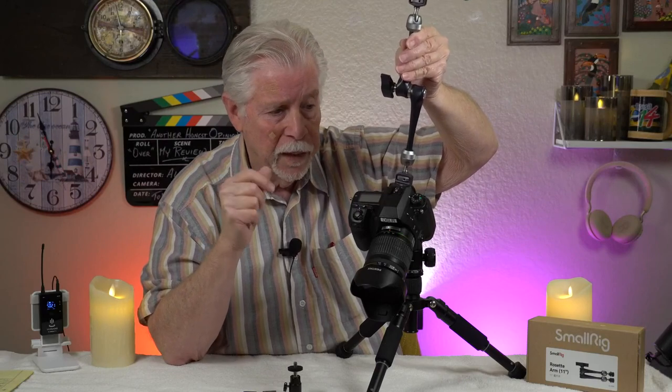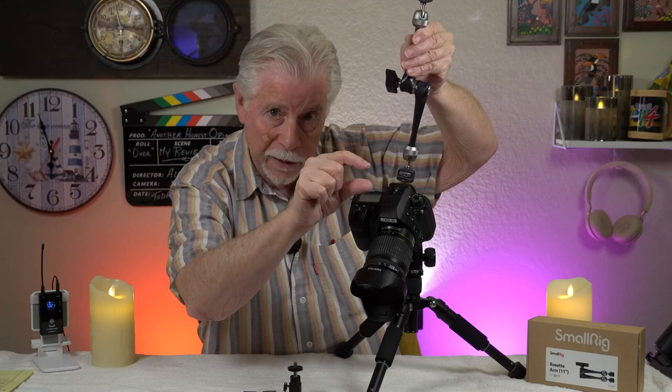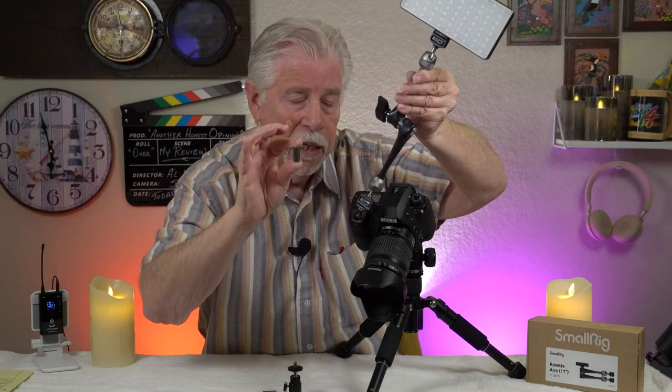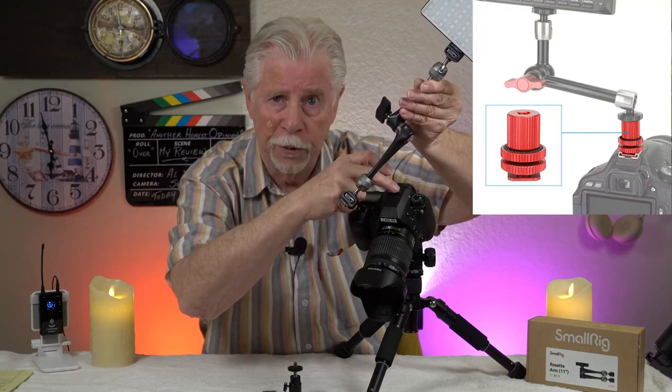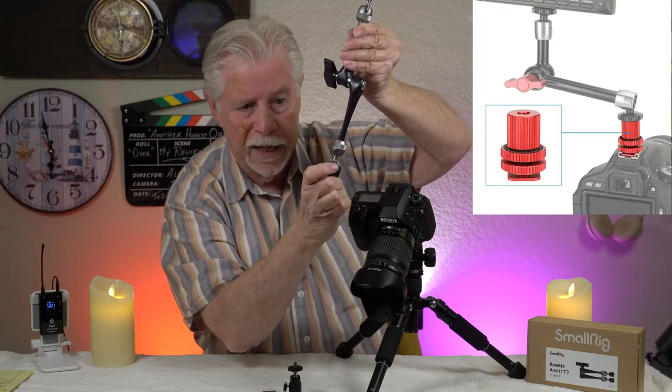So what I immediately did, without the adapter that I wanted — and I'll show you that adapter — I thought, how do I go from shoe to a female quarter-20 such that this can screw in? Typically, when you've got to go female to a male, you get what's called a coupler. Here is a very standard hardware item: a quarter-20 coupling nut. It's about an inch long. I actually ordered through Amazon a formal adapter which will take you from a hot shoe or cold shoe to a female quarter-20, where you can then screw this arm in and tighten it.